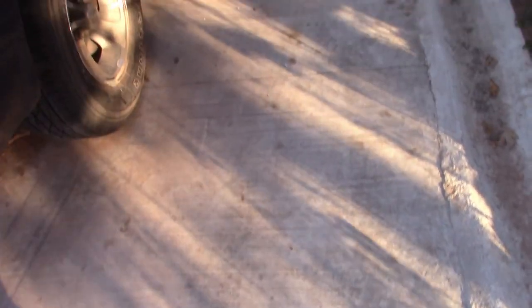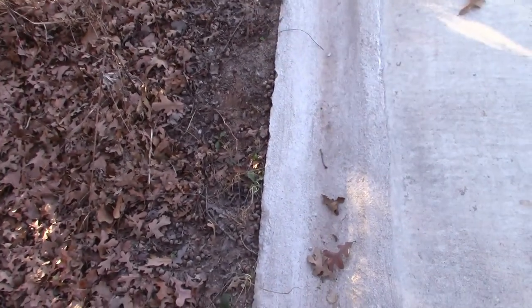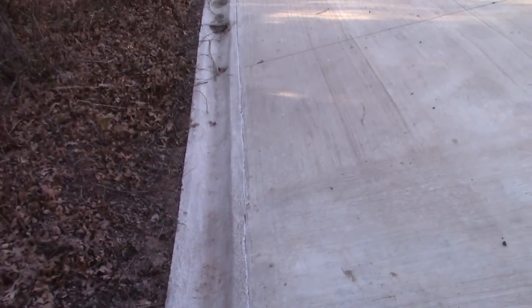You can tell I didn't go all the way down on one side because it's not cracked yet at all, so I'm not going to make it crack — I'll just leave it and can always add to it later. I did grind all that down and knocked off all the rough edges. See how that was chunky right there? I took that away by grinding it so all the sealer will fall deep in the groove and not hang up on something.